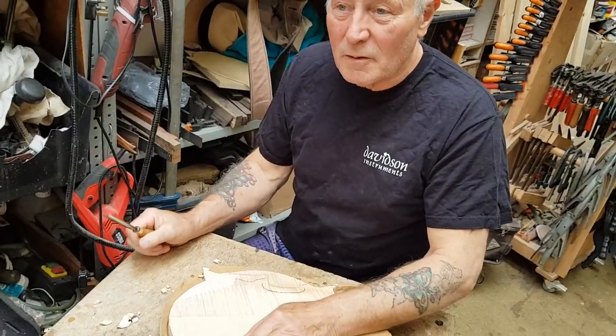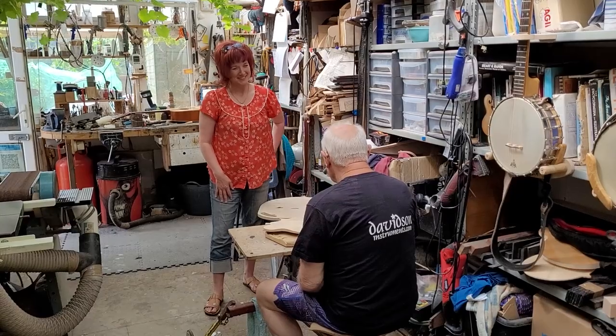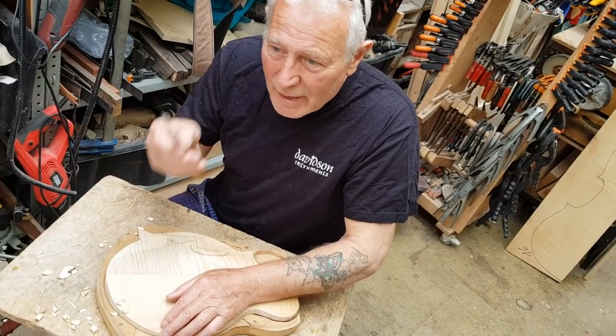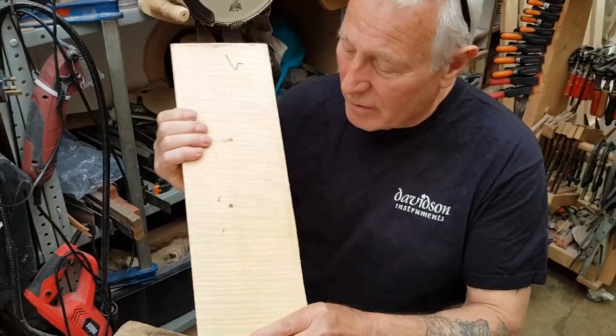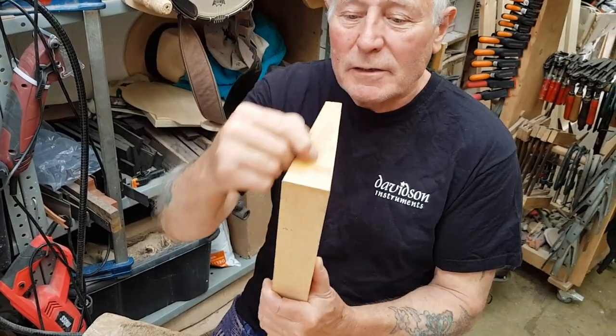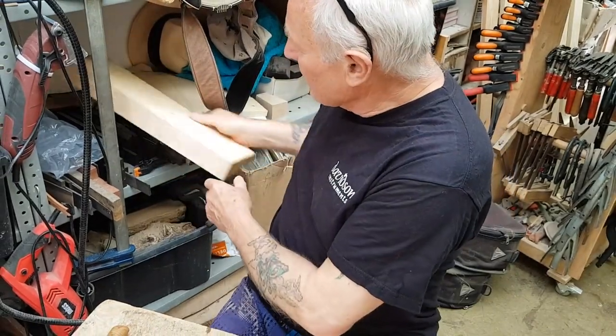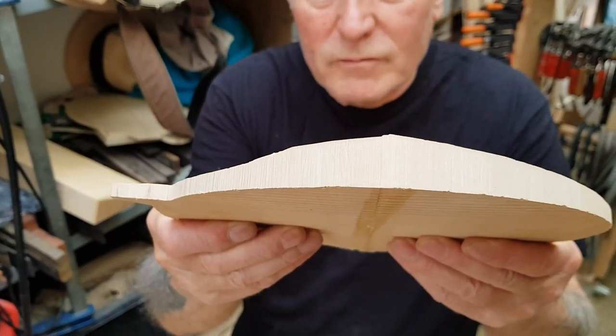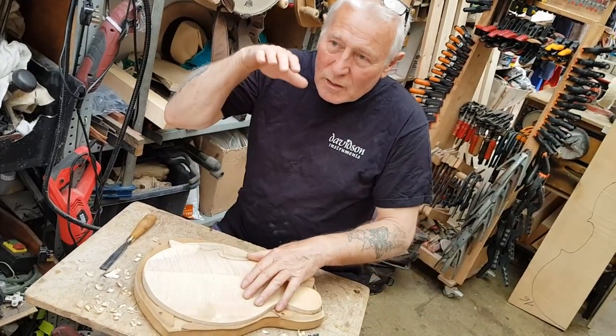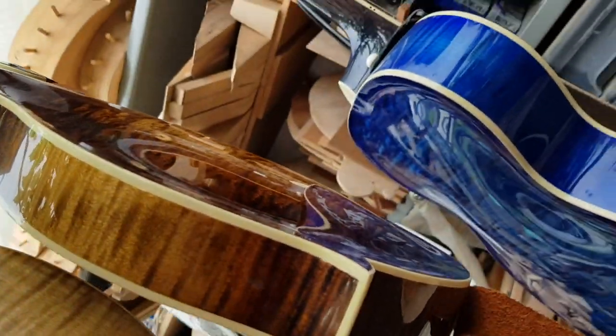So Phil, how long will it take to make a mandolin? Probably six months to do the back, although I'll be working on various other instruments at the same time. And if I really thought about how long it's taking me, I would probably retire. So what's the process to make the back of a mandolin like this? Well, Lois, we'd start with a violin back blank — this is very, very high quality Slovenian maple. That is going to be divided down the middle and then jointed edge to edge. You can see the thickness I'm starting with. That is going to be carved down until it's a perfectly graduated arch — we're giving the wood a voice. This is going to sing.